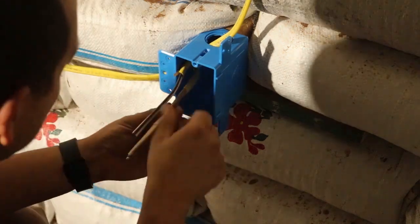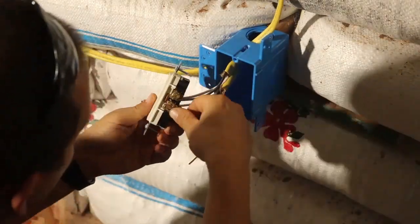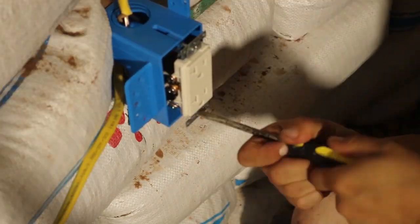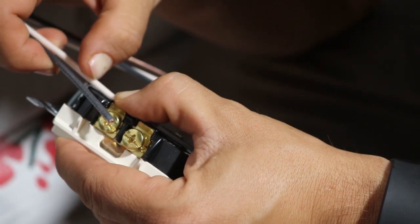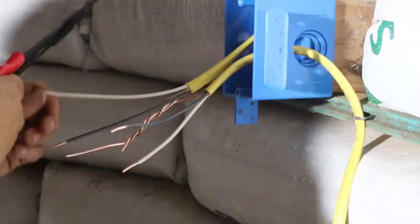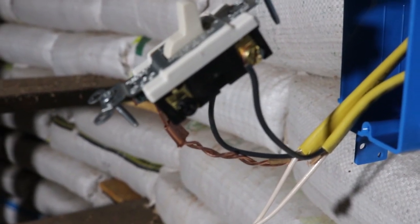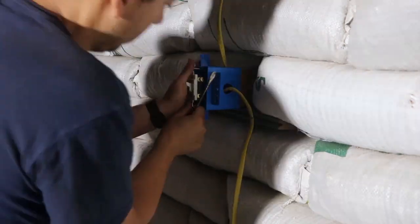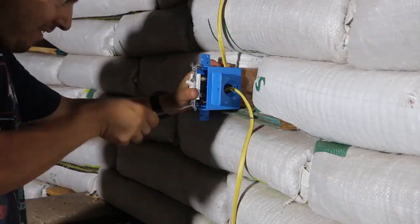It's just two receptacles and a light switch. So this is my first receptacle, so I'm kind of excited about that. First receptacle is wired up and ready to go. I just got one more receptacle, one more light switch, and the bedroom is done. All right, so I got my first ever switch wired up. I put this crimper sleeve on the grounding wire. I think I'm supposed to do that for the others, so I'm gonna go back and add the crimping sleeve to those grounding wires. But otherwise, I'm pretty much done down here.